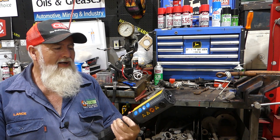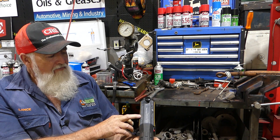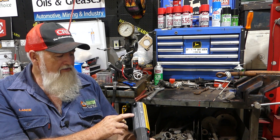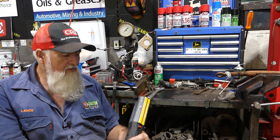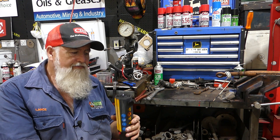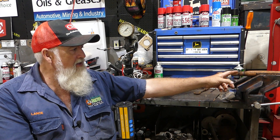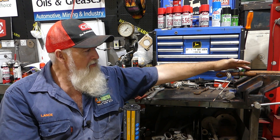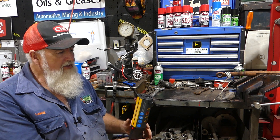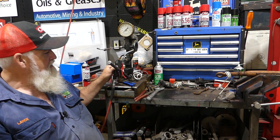Well there you go — that's our play with the Sparex induction heater. A few little things from Sparex.com: rated current 4.5 amps, coil output voltage 18 volts at 50 amps, frequency 50 to 60 Hertz, power output 1000 watts, input voltage 220 to 240 volts. That's a good thing. The couple of little jobs I've done in the vise — it's done them no worries. It is struggling a bit because I've been using it a bit. It may be because it's a long tube, but I think it's more that it has a reasonably short cycle time. After two or three turns it shuts itself down on thermal overload — just shuts down and then starts again on its own.